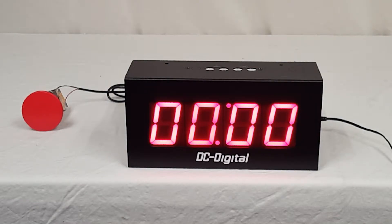Hello, this is Jim with DC Digital, and today I'm demonstrating a DC-25T-up with BCD rotary set switches installed. The customer wanted it to be able to set it to a maximum value or a threshold value, and then have a three-second alarm after it reached that value. Also, when it reached that value, it would stop.